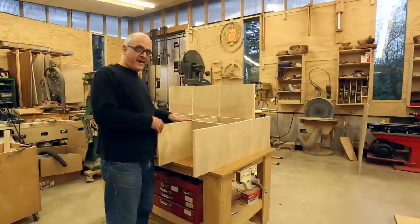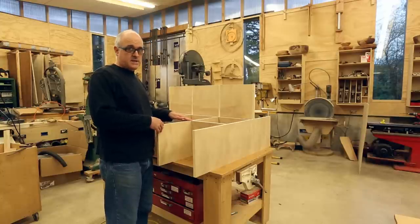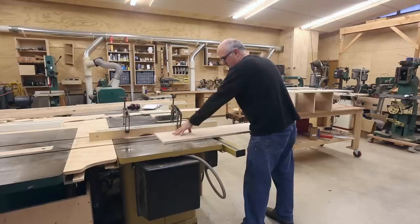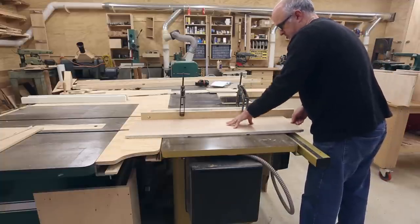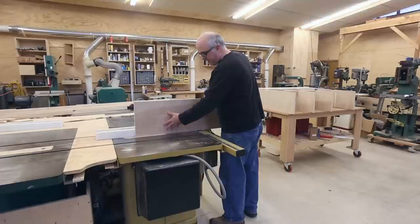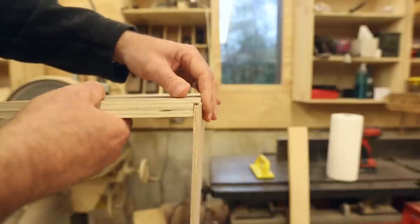I'm going to put the back on and I like that to be hidden. So I have to cut all of the inner pieces three-sixteenths of an inch thinner, and put a rabbet around the edge that's three-sixteenths to take the three-sixteenths back. After a test, I have my rabbet depth set. Instead of putting a dado blade in the table saw, I'm just going to cut the rabbet on both sides — run the board through one way and then tip it up and run it through the other way. This seems easier than setting up the dado blade, and it seems to be perfect.